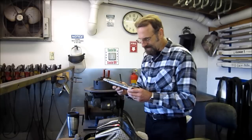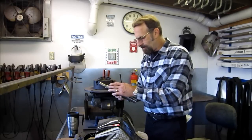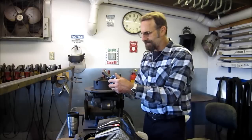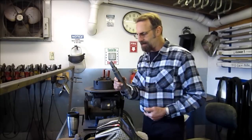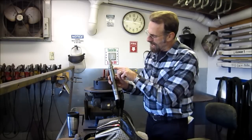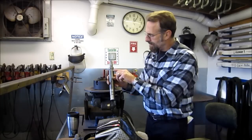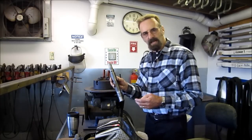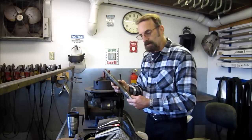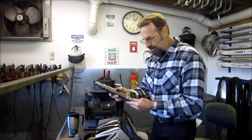So today's slider is a shaft for another machine. We've got two bearing diameters on here — one's perfectly fine, and this second diameter here is an eighth of an inch worn. We've got a snap ring groove at one end, just like at the other end. We're going to set it up, weld build this, then remachine the bearing fit, and get this back to him today so he can get this assembled, and then we can get back onto his other project.